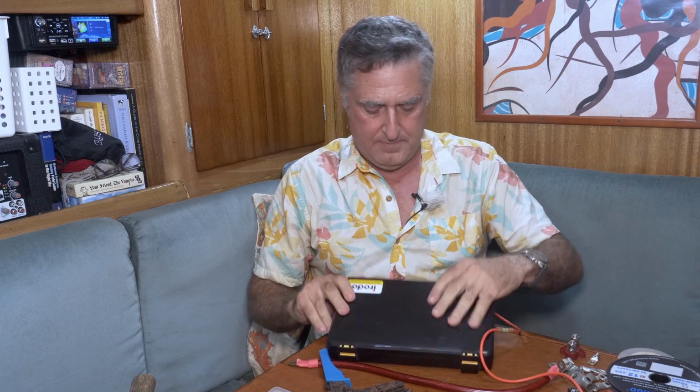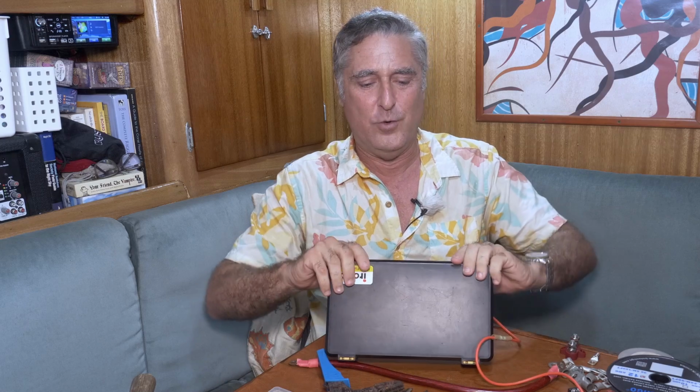In this one, the plastic parts aren't just there to kind of shield from touching. They're actually a shrinking plastic with some glue inside. So if I heat these up, they'll shrink down on the wires, glue themselves to the wires, and make this quite waterproof. You can do this probably most easily with an electric heat gun, but I don't like to pull out cords. So I've got my handy dandy portable soldering iron, hot knife, butane powered device here.